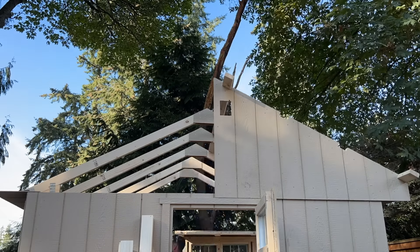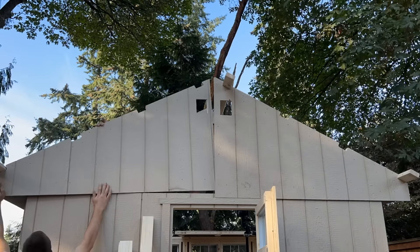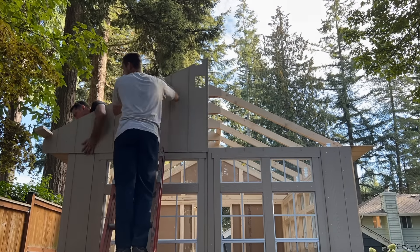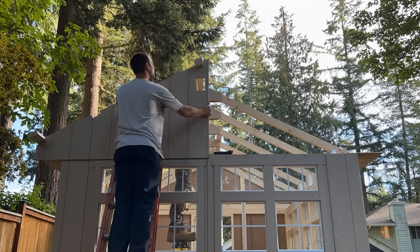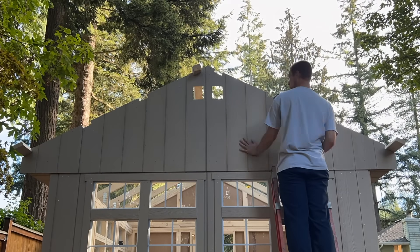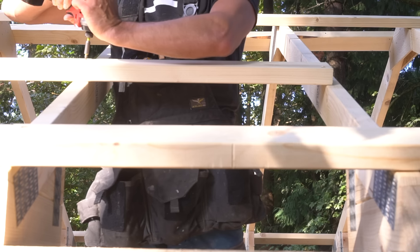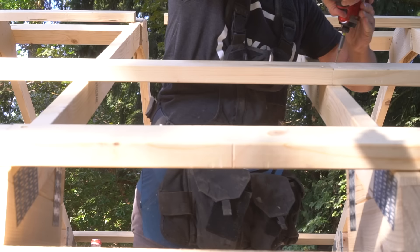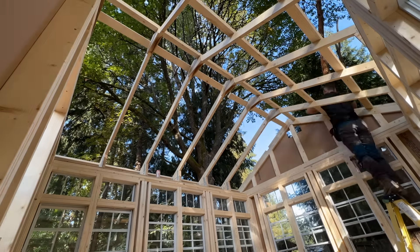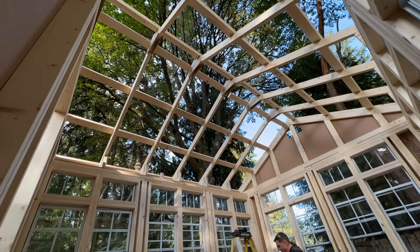You do need to double check for levelness to guarantee that these panels are correctly positioned. Once correctly positioned with our first panel, I then install our second panel and screw them together. Once I had the front panels fully installed, I went to the back side and installed those as well. Keep in mind that these panels are also a bit heavy, so you do want to have a second helping hand if possible. Once I had both the back and front taken care of, I could then continue with my framing structure all the way up. Remember that there are multiple sizes for staggering all these pieces of wood, and they're already pre-cut, so just make sure you're following the correct staggered pattern that comes with your installation kit.